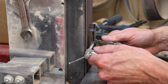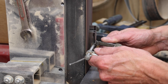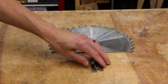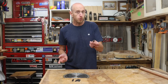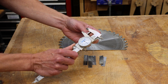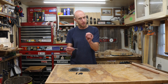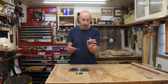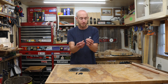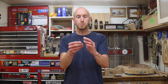Once the edges are square, I'll clamp all of these pieces together so I can finish sizing them all at the same time — this helps me keep them all at exactly the same width. I've got them right at a half inch, if not a thousandth or two just under, so that when we make the wooden bed later I can make sure that's exactly half inch and I'll have just a tiny bit of wiggle room. Now I think we can move on and put an initial bevel on here.